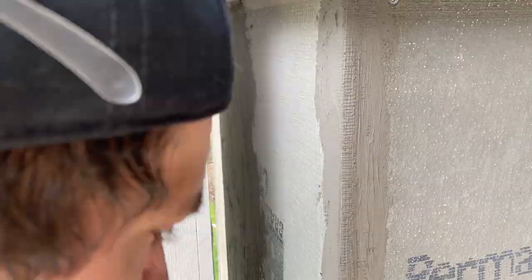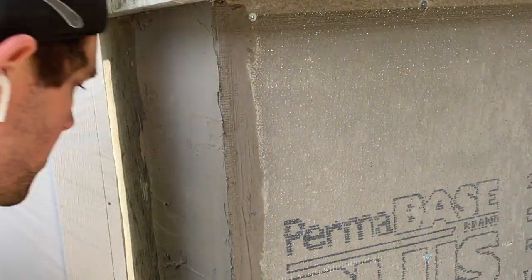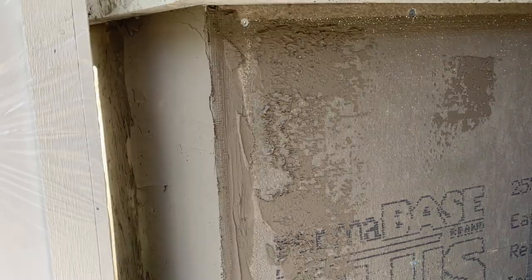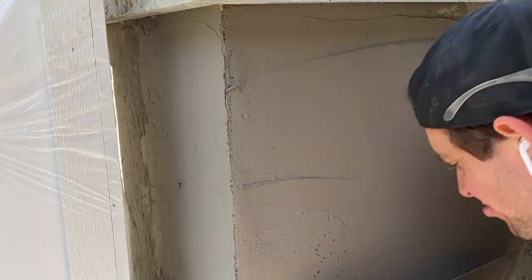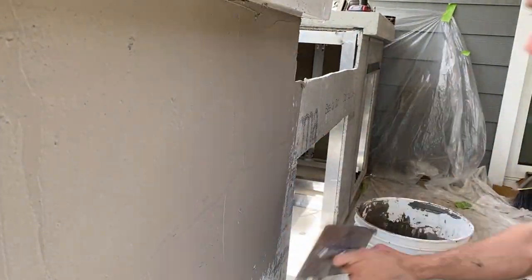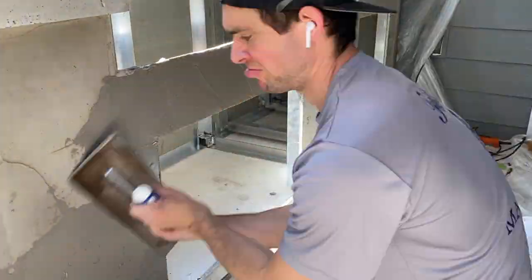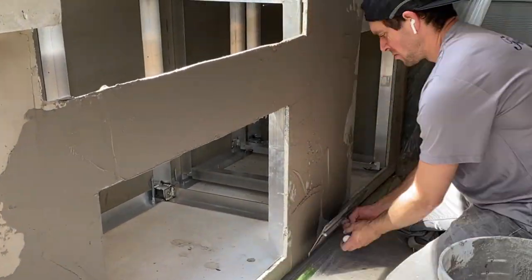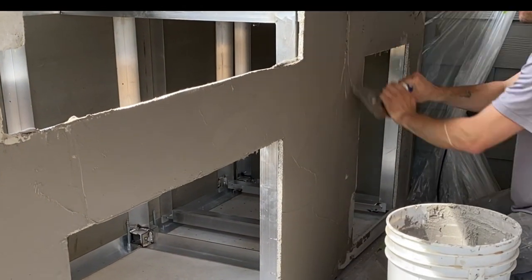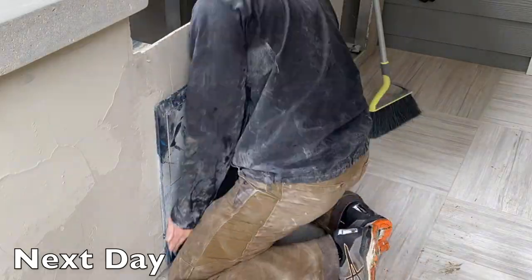I gave myself about four to five inches of space between the side of the cabinet and the post, and that wasn't quite enough room for my trowel, but I did have enough room to get my hand in there. With this product and the natural look we were going for, I was able to create a very natural texturized finish with just my hand in those tight areas. Let the product dry overnight, then come back the next day to install the cabinetry.